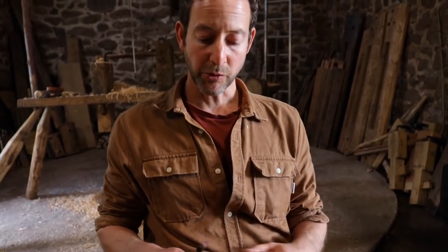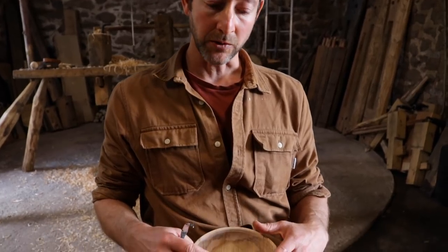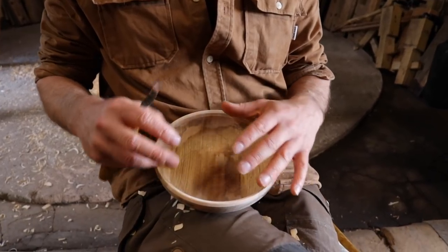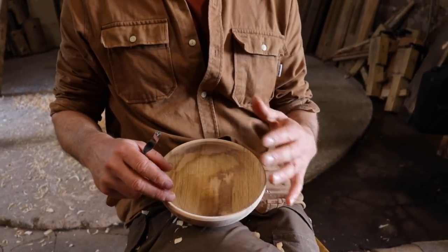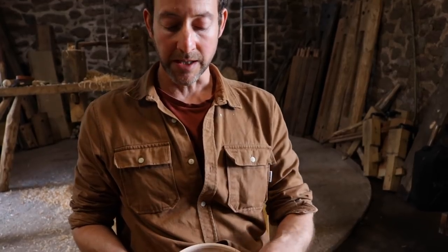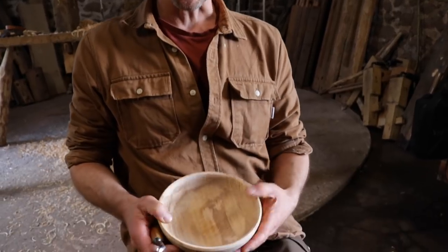And just leave it somewhere for 24 hours, at which point that material will feel quite damp because of the moisture that's being lost from the wood. So that allows the moisture to leave the bowl, but keeps it close so it's not drying too fast. After 24 hours, remove that damp cloth or that damp T-shirt and put a dry piece of material around it. Leave it for another 24 hours. That's just the safest way that I've found of slowly drying a bowl. And after a few days, when the material no longer feels damp after you've changed it, you can then just leave it in a room somewhere.